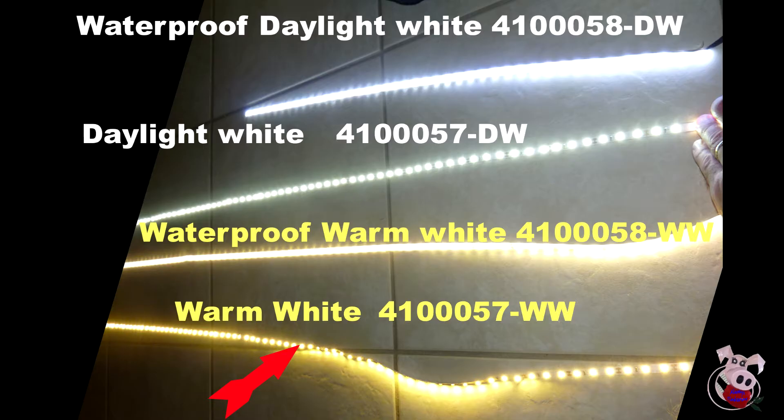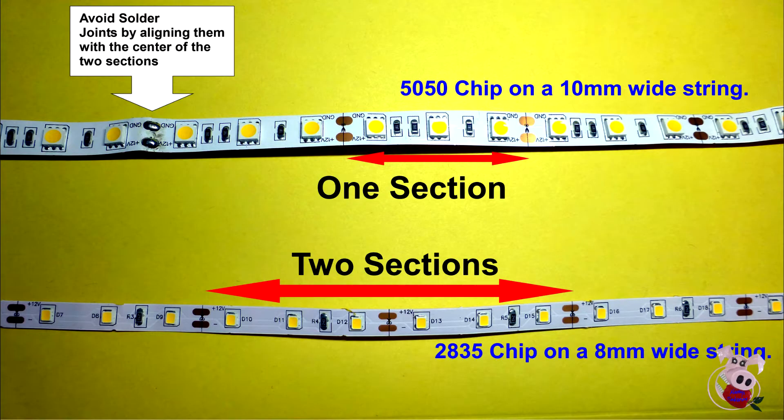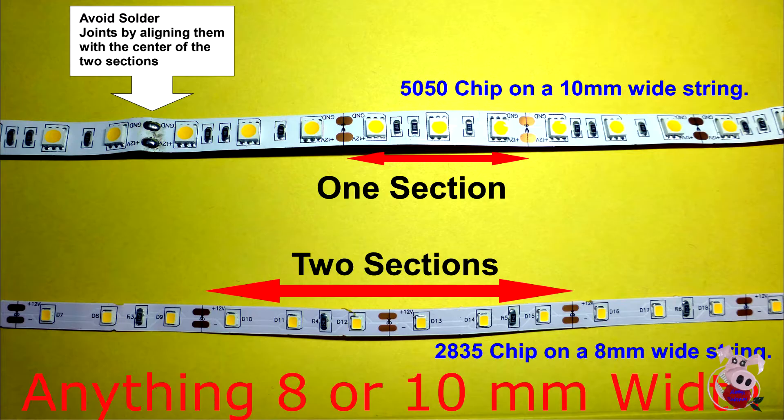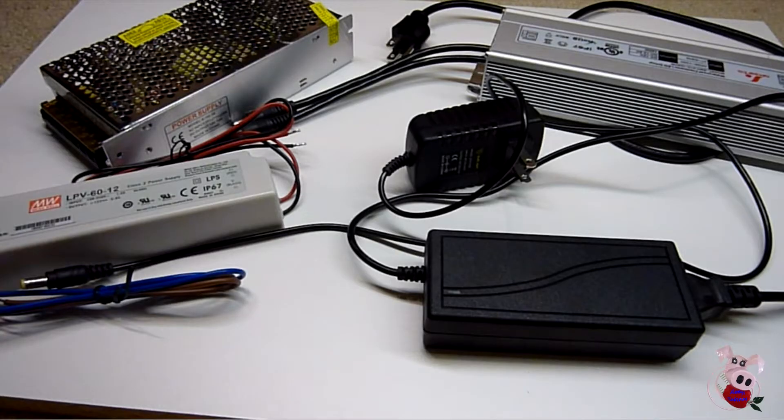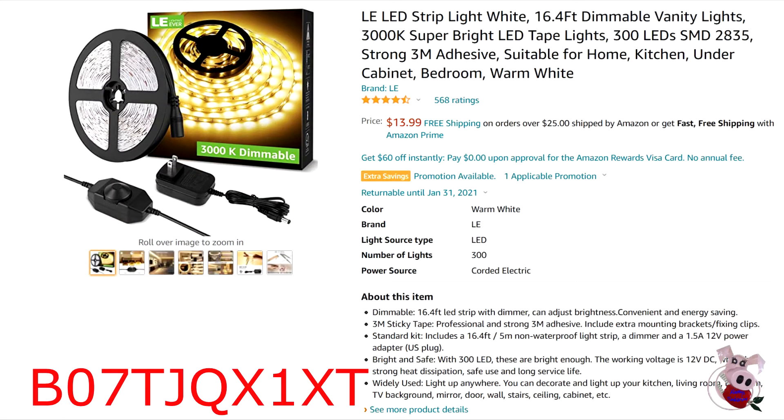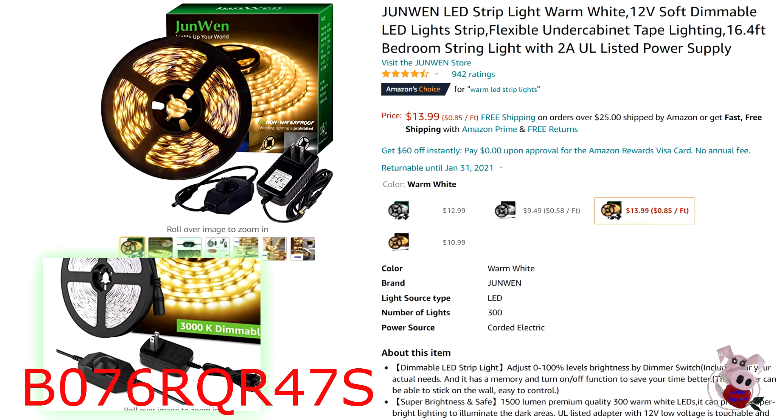For this conversion, you'll need some LED strip lights — I'm using warm white, though there are many more LED types available. Try to use one that has a 10-millimeter or 8-millimeter wide strip so that accessories are available to avoid soldering. You'll also need a 12-volt LED power supply. If you don't have a power supply or the lights, you may just want to order a kit, which will give you the power supply, the lights, and probably a dimmer at a reasonable price.